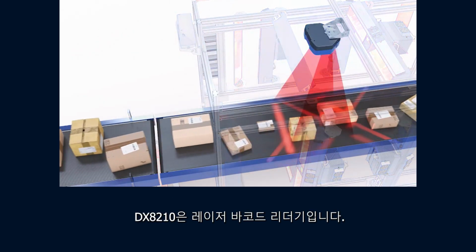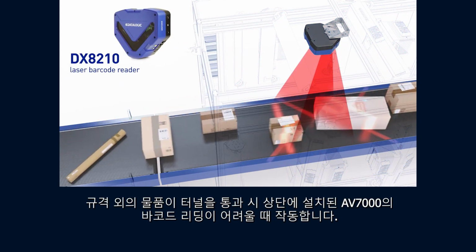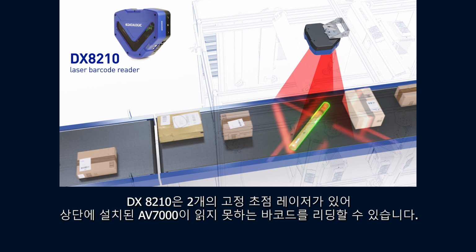The DX8210 is a laser barcode reader. It comes into play when a non-cuboidal package comes through the tunnel, which can restrict the top AV7000's ability to focus on the barcode. The DX8210 has two fixed focus lasers per leg, which may be able to read the barcode that the top AV7000 did not.